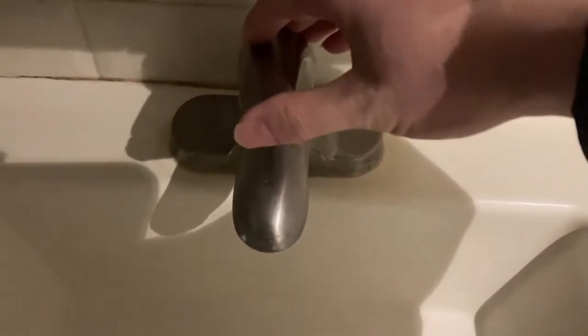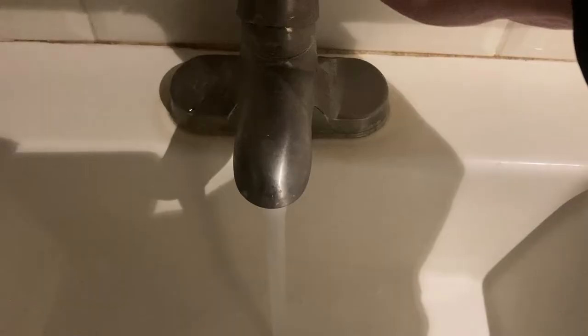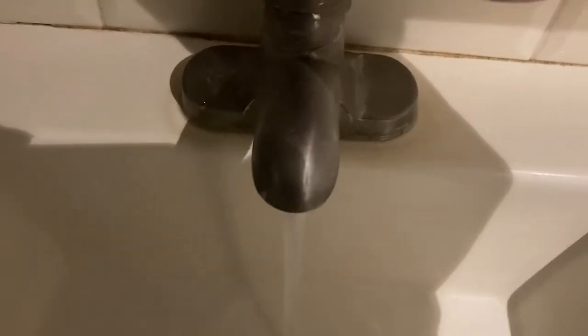Recently, I noticed something wrong with the water pressure in my home. When the faucet is opened, the water pressure is higher than normal in the first 2 seconds and then decreases quickly to the normal stable pressure. If the faucet is closed and immediately opened again, the water pressure is normal from the beginning.